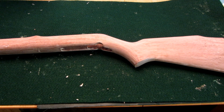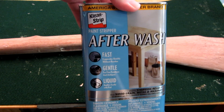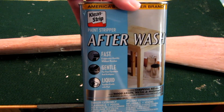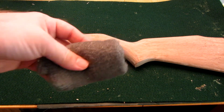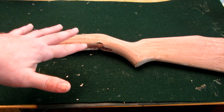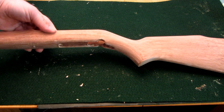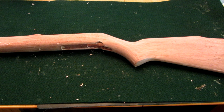My next step is to use some after-wash, which will help remove any stripper residue that's left on there so we can start with a nice clean stock. I'm going to apply that with some 4-aught steel wool, which will serve not only to help wipe it down but will actually provide a kind of pre-sanding of the stock itself. In the next piece of video you're going to see a sanded stock and get a chance to look at how that looks.